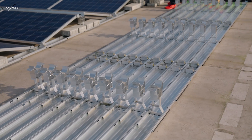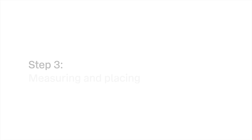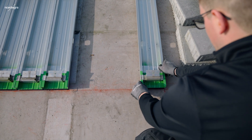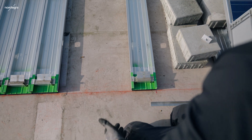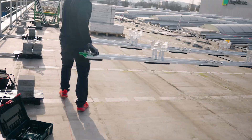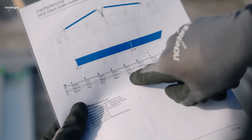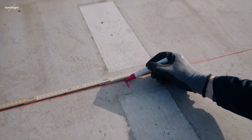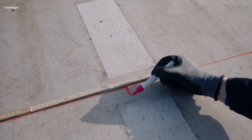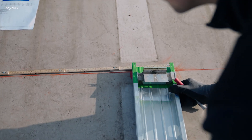The base rails are ready and all the mounting elements are installed in the required positions. The base rails must be placed in the appropriate areas. Solar Planet software gives us a clear indication of the spacing between the base rails. The long red line we have prepared indicates the edge of the whole system, which is parallel to the attic. On this line we shall indicate the spacing of the individual profiles to make it easier.